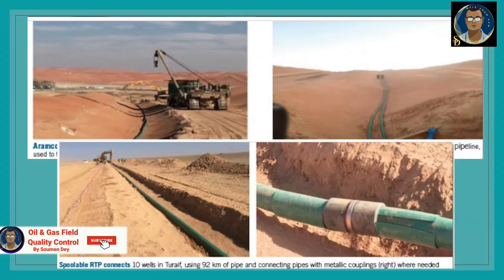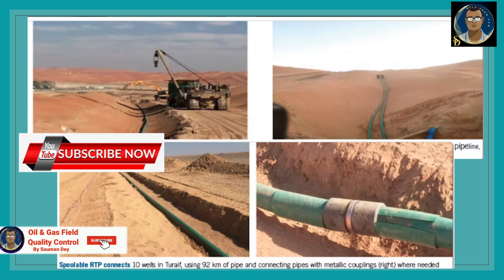RTP line pipe is an electrical insulator, and in applications involving transport of non-polar fluids such as dry gas, liquid fuels, or pure hydrocarbons — especially at high velocities — a static charge may be generated on pipe surfaces. Grounding and static control procedures should be employed during any intervention, as static electric discharge can ignite a flammable gas or combustible atmosphere. In RTP line pipe applications involving transport of wet gases, liquids, or multi-phase flow containing water, no significant static charge is generated on the pipe surface.